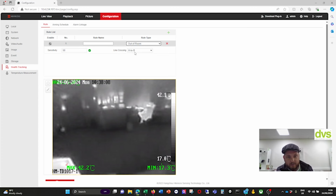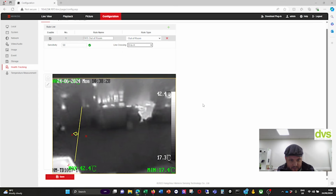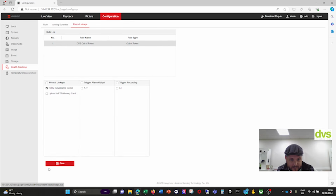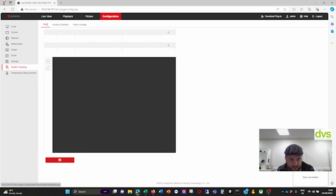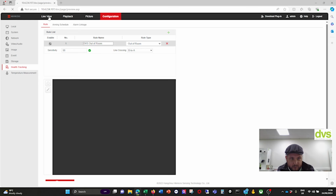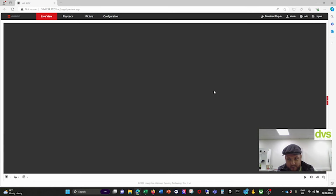So again, if I go out of the room and just put DVS out of room, sensitivity is 50, then line crossing is A to B or B to A. So if I draw a line and just put, say, out of room, and click save, we've got arming schedule and alarm linkage. What we should see now is when I go across this threshold, it should go red to show you that it's an alarm. So I'll just go back to the live view.